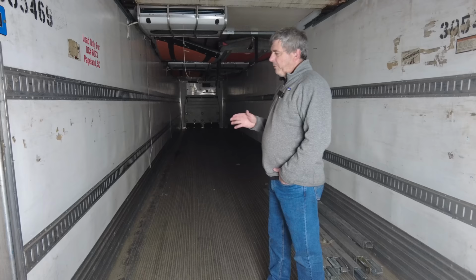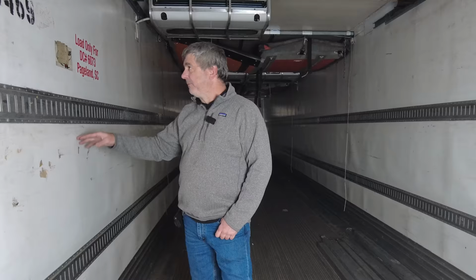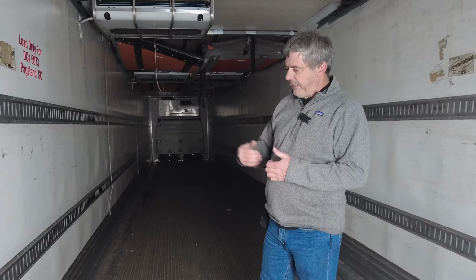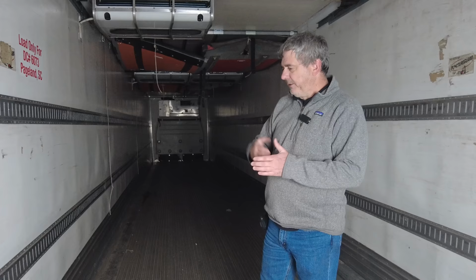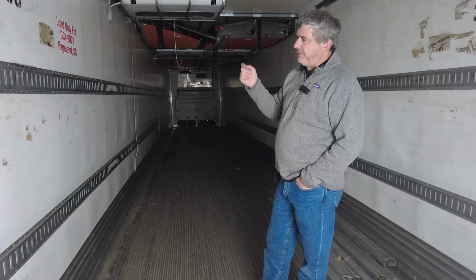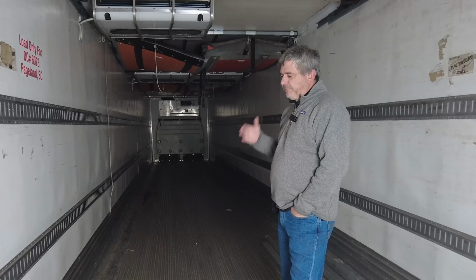The way they make these trailers is they vacuum mold the closed cell foam behind this outer piece of fiberglass, and then it's bonded all the way through. And then that way they get rid of the thermal bridging from the inside to the outside. The outside ribs of the trailer that we saw that have the strength in it, they kind of offset to the inside, and the closed cell foam kind of holds it all together. That's how they get rid of the thermal bridging, so they don't have a piece of metal that's like at minus 30 degrees when outside it's 100 degrees, so you know it'll sweat or mess up. That's why we really like these trailers, because they give us a great solid foundation to start on.